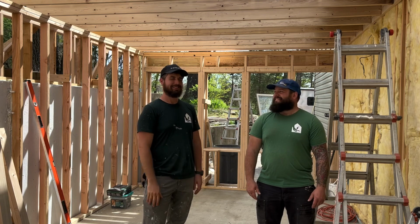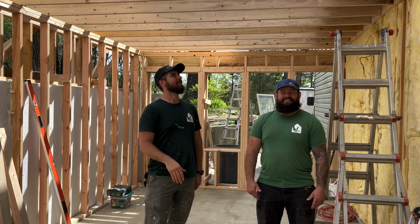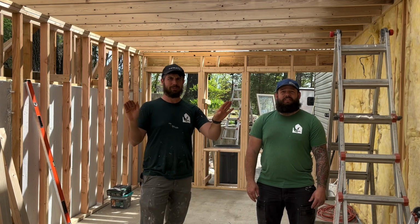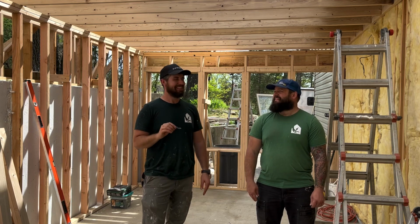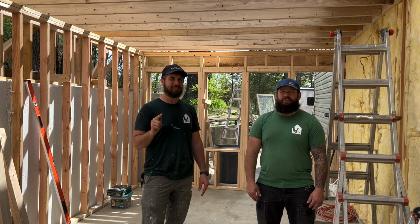Rafters. Put in our rafters. The thing that the zip is actually going to be nailed to, to call it a roof, which are going to be put up above these guys at a very slight slope. How slight? A 4-degree slope. Just very slight. Which makes it pretty difficult to cut such small angles. But we're going to do it, and it's going to look darn cool.